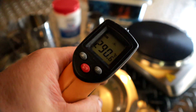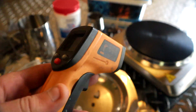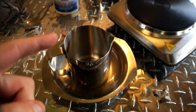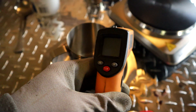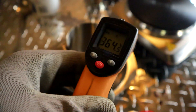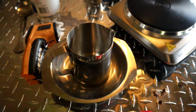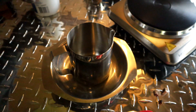Now we're at 290, that's 312. You can use one of these thermometers just to double check your element. Once that gets to 350 we'll check that on. So we'll put the safety gear and gloves on. We're checking the hot plate again — that's coming back at 364, it was overloading at 380, so just adjust your thermostat down until you get it to roughly cycle on and off at about 330 degrees Celsius.